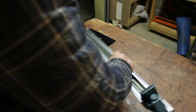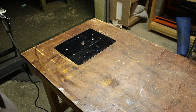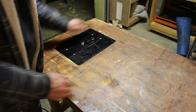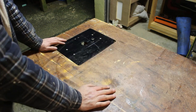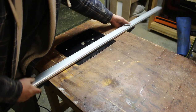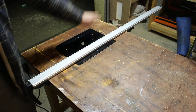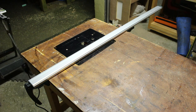A new feature to the shop is the way I've laid this out a little bit. This end table I made on a previous video — there's a link to that video just appeared there for you. One thing that annoyed me was that I didn't have anywhere to put a fence for my router and I never built one. What I've done is rotated it round 90 degrees — it still acts as an outfeed table — but I can now use this straight edge clamp as a guide for when I'm routing. It's much simpler. I've lost a little bit of real estate at the end of the shop but that's no biggie. I have gained space over there though, so it swings round fine.